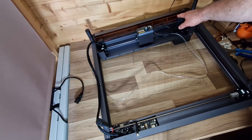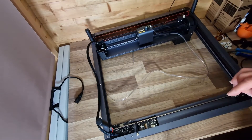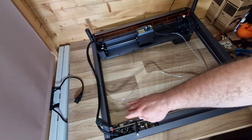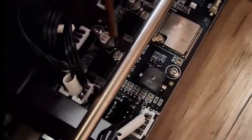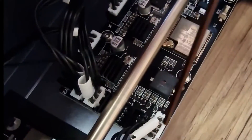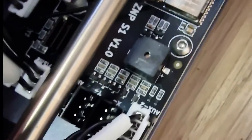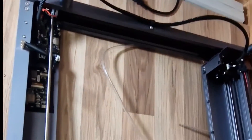On the paperwork it says to have the motherboard up in the top right hand corner, but I'm going to have it up this end so I can zoom in on the motherboard and show you where the two connections for the X and Y are. You don't need to do any modifications to the board itself — it's ready to go. You've got the screen cable here, and then the X and Y are these two ports here, clearly marked.